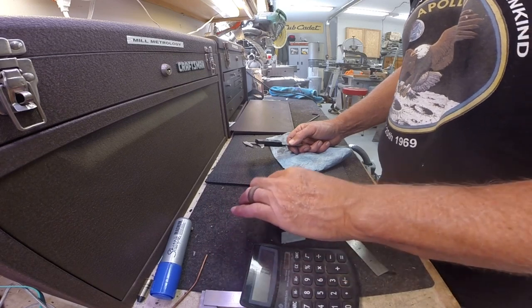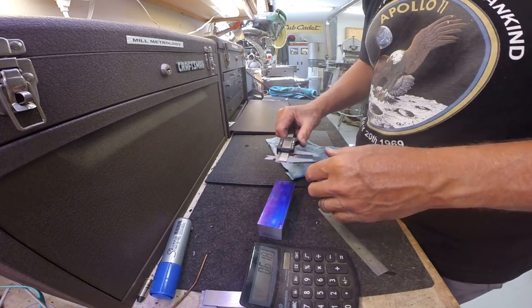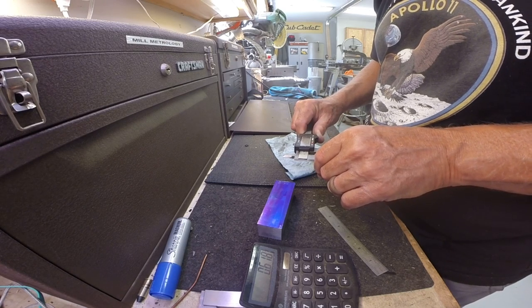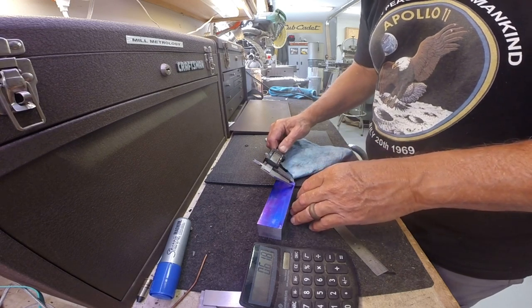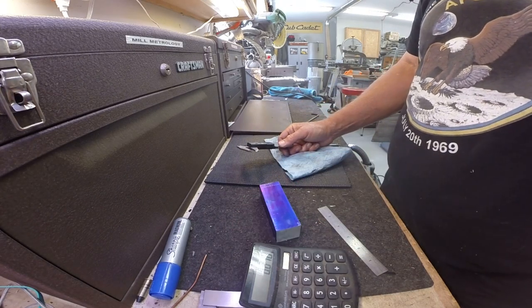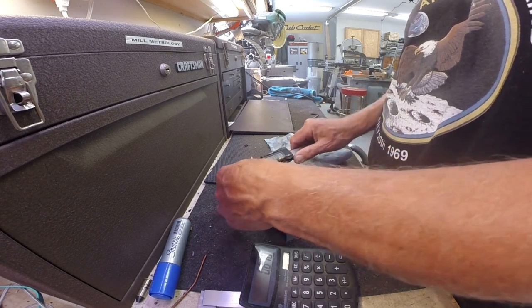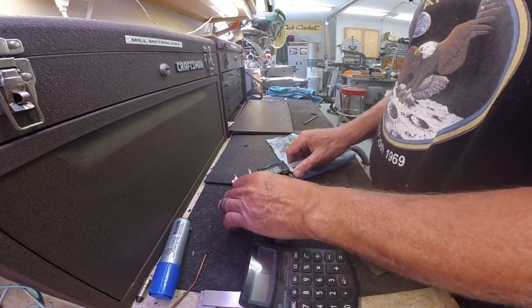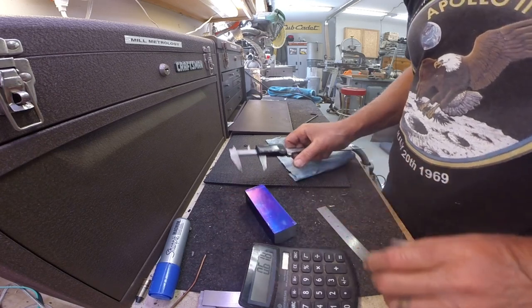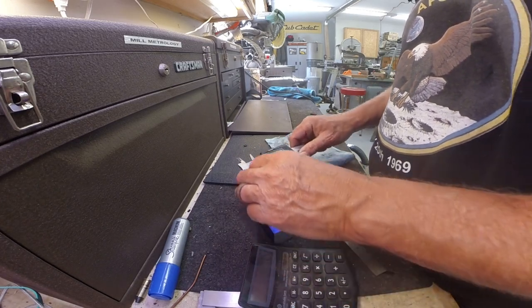All right, back here I want at least 3/8 inch, so 0.375. Across the back clearance, then we'll want a 1 inch diameter hole, and we'll go ahead and center it on this. All right, so it's 1.501, so we'll call 1.5. All right, so it's 0.75 would be the center line.